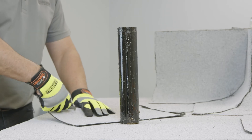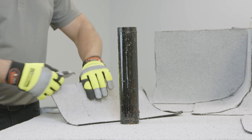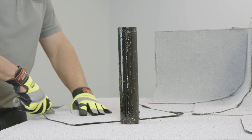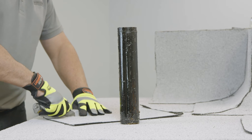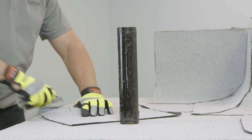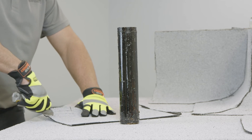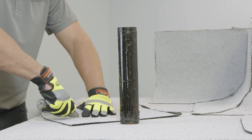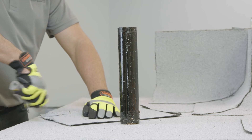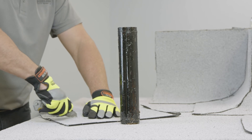It's really simple to do — just grab it, make sure you have a mark where you have four inches for the base of the flashing. Go through all the way to the end of the membrane. You're cutting these finger flashings because they're relief cuts; they're necessary — it's the only way you're going to get the membrane to wrap around the pipe.